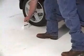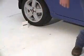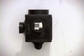Next thing we want to do is to be able to measure the floor slope. Put the G2 transit at the front wheel or front axle and the target at the back axle. We want to be able to see the target looking down through the top of the G2 transit. You can see where the lines are. You will want to turn the thumb screw until the lines are parallel.